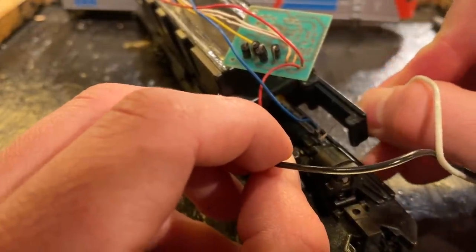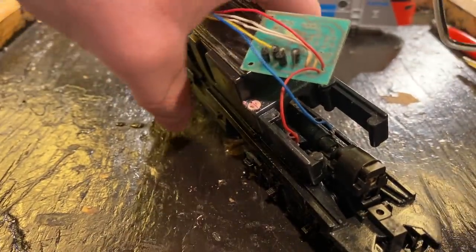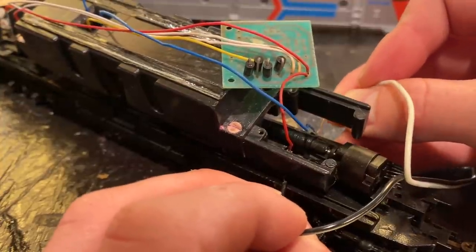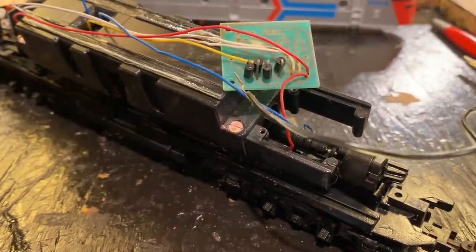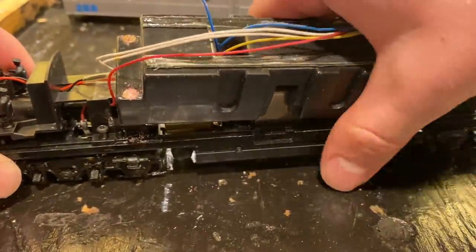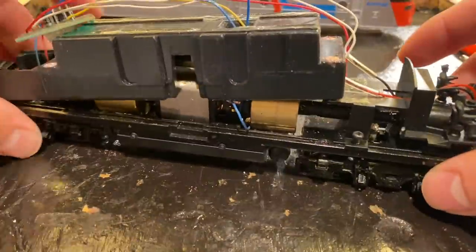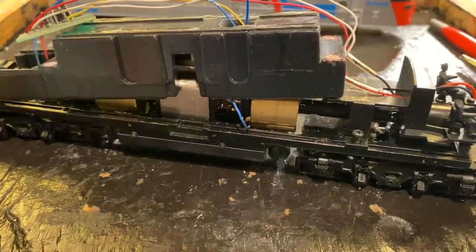Let's try giving it some power here — if this thing fires up this will be a first. I'm going to turn up our power and put a bit of power on each of these leads. You see that? It's turning! Let's try that again — it's trying to go. Yeah, it's running! You can see the light coming on there too. It would appear that the dirty commutator was the source of our problem. I've probably restored over a hundred model trains over the last ten years and this is really a first for a repair — what an unusual thing to encounter.